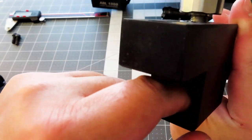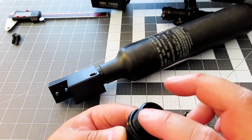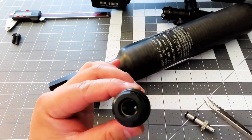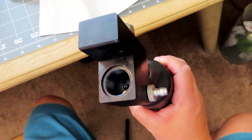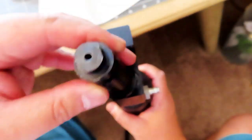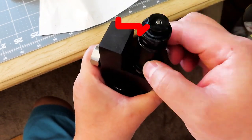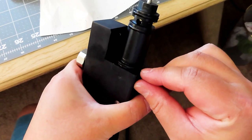So the seal is, there's a back pressure to the seal. And I'm looking at this, I believe this is the one holding the seal back. That looks fine. Everything looks good. So let's put this back together. Okay. Seal's back in. This little hole right here, it's where it handles the pin. Drop the straight back in there. The pin should show up on the other side. The seal is compressed in here.